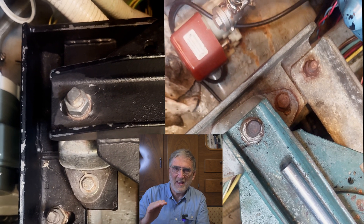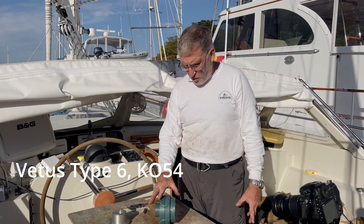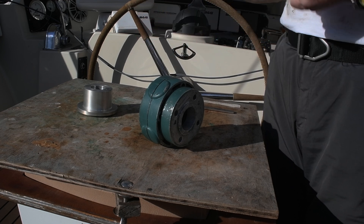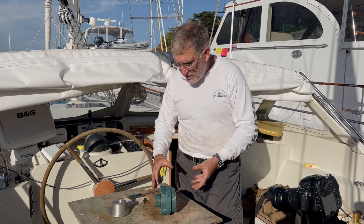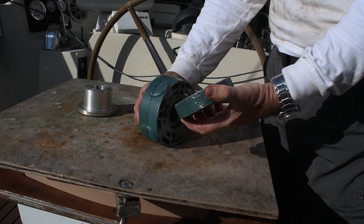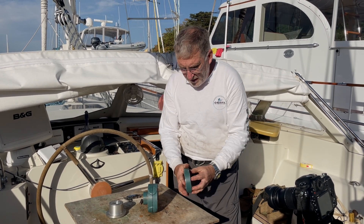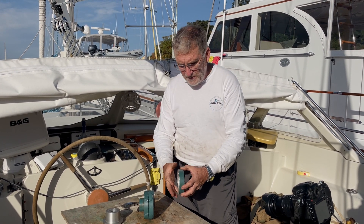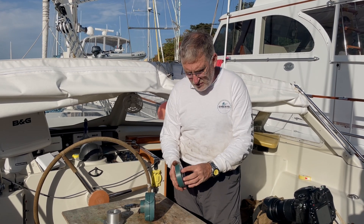So with all that out of the way, let's head up to the cockpit for a description of the equipment and the issues involved. This is a Vetus Type 6 shaft coupling — the Vetus part number is KO54. The KO54 is an unusual one because it is not a finished part; it's left for the user or purchaser to finish the machining on it. So it's best if you can just buy it from Mel, because they've already done the machining. There's a couple of parts here. One is a part made by Mel — this goes against the transmission on one side and against the coupling on the other. If you have a shaft alternator, this piece is replaced with the large belt pulley for the shaft alternator, but otherwise they're identical and you work with them the same way.